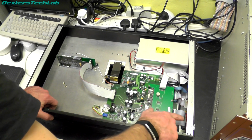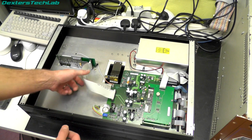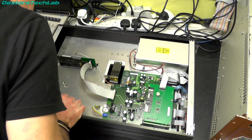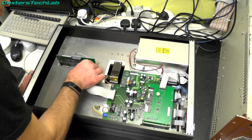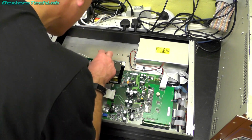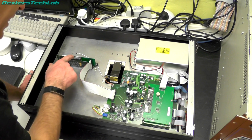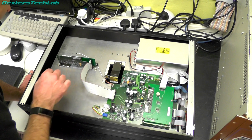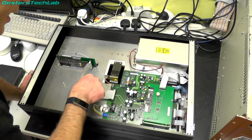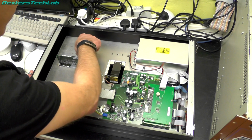There's a small board in the back which just houses the connectors and all that sort of stuff, the LEDs. We've got a ribbon cable running over to this board which sticks out at the bottom. So I'm not 100%. There's actually an interposer board, so it comes on through this ribbon cable onto this board, which then plugs onto this one. So they've obviously added that on for some reason. I can't see if there's anything on it just yet, but it looks like that is literally just to bring the connections out to a convenient place just here. The connections for that disappear through onto the other side, and then right in the middle we've got this bracket with a small board on it, with what I think is SMA, with a coax running through to the other side.